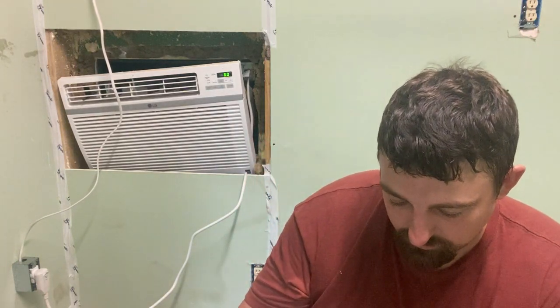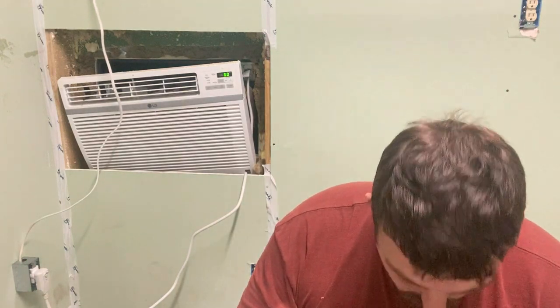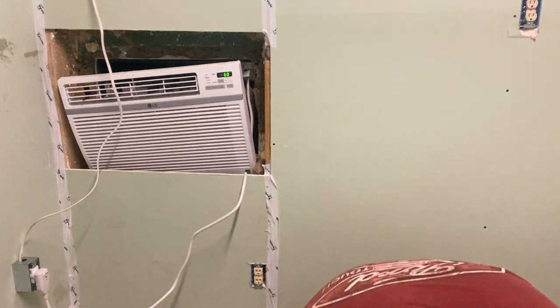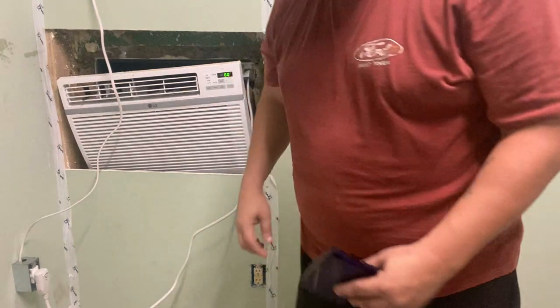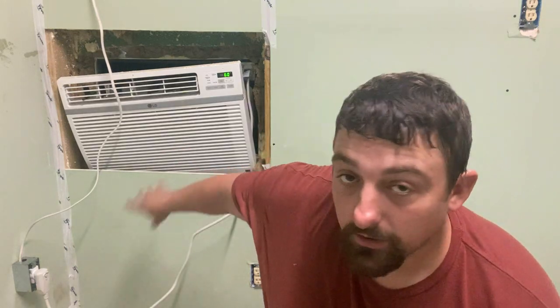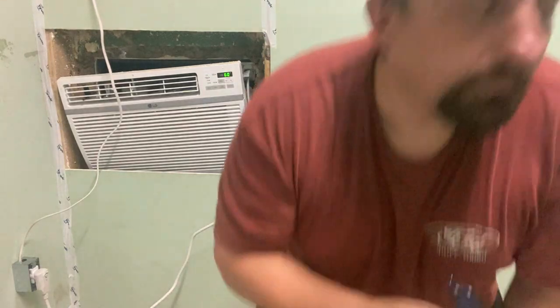All right, so with the CoolBot, we've got 10 steps to follow. We've got the Welcome to CoolBot pamphlet, and a piece of tin that we're going to require, so I'll show you guys what we do. Okay, so they've got pretty good instructions. I'm kind of impressed. So basically what I have to do first is, there's only one thing attached to the coils on the front here. That's the temperature sensor. So it's instructing me to take that temperature sensor off and use this one in place of it. So I'm going to go ahead and do that.